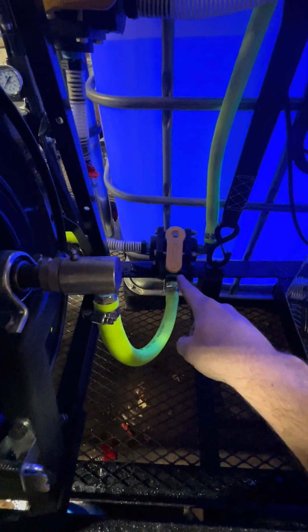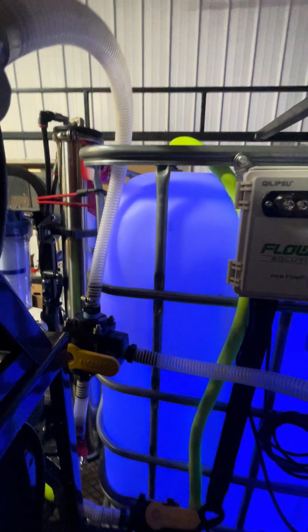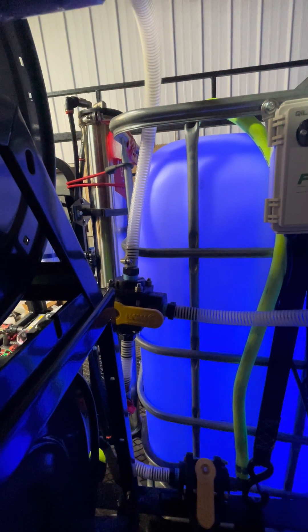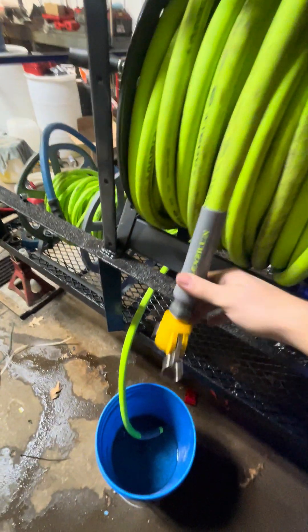It will run to this three-way valve. The reason I have a three-way valve is I also offer window cleaning, so this year I bought a Tucker water-fed pole system — super excited about that. But once I hook up to a spigot and hook the three-way valve that way, water runs into the tank. On the inside I have a float valve that will stop the water once the tank gets too full. If I have the lever the other way, water will run to the water-fed pole. I also wanted the option to have water run to the pole from the tank without a spigot, because I'm going to be offering solar panel cleaning — it might be in remote areas where I don't have access to a spigot.